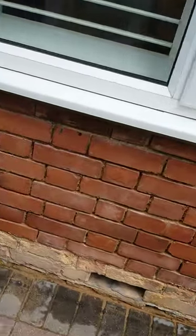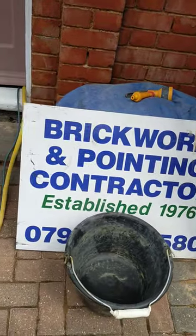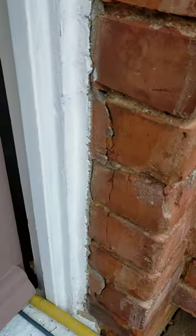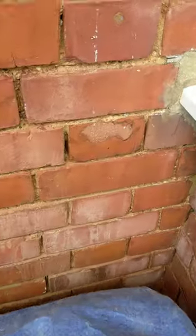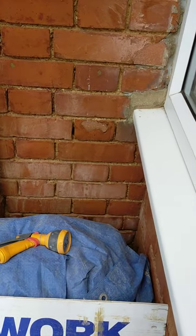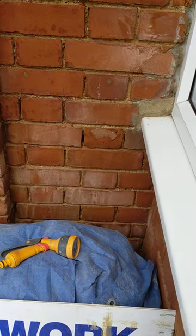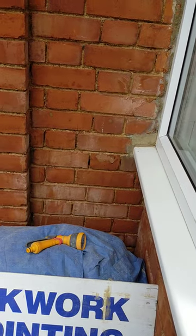Right, just got a few brick repairs I want to get ready today. There's a few bricks to change — these sort of things, there's a problem here. I'm going to take them out and change them. A few other bits like here where someone repaired before, it's discoloured, so that's all going to come out. The problem is if you start hacking headers out, you can damage — it's a nine inch wall — you can damage the decoration inside.